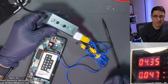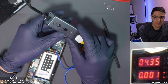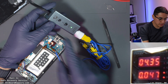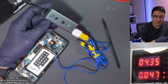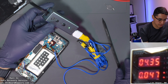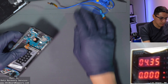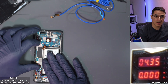I push power and we have a 47 milliamp draw before prompt to boot. That means before I even push power on the phone — think of it like a car engine when you crank the key. This is just putting gas in the tank; it's not turning the car on, so there should be no current draw. But we have some, which is a clue. On Samsungs, a small draw like that typically indicates a short on a main power rail.